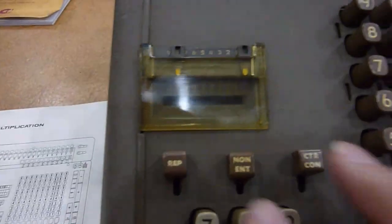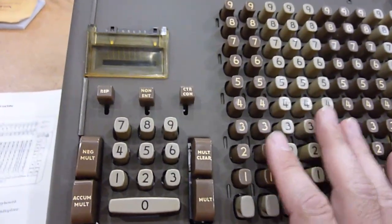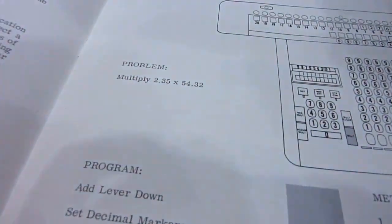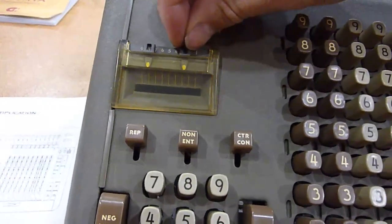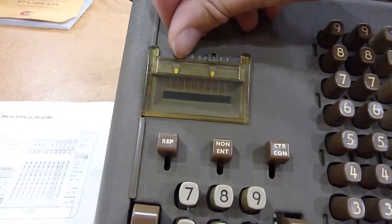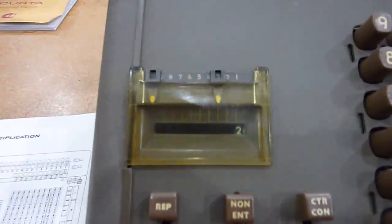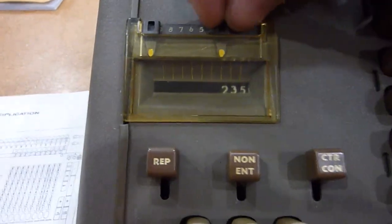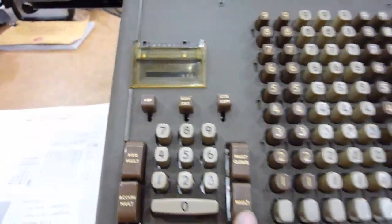Multiplication — much more fun. There is a little dial on the side for multiplication; you use this for one part of the multiplication and this for the other part. Let's do the simple problem: 235 times 5432. So we have to set the decimal points a little differently. I input 235 into this little side keyboard and add two decimal points here and two decimal points here — that makes four. I don't need to clear it because the multiplication button will do it for me.